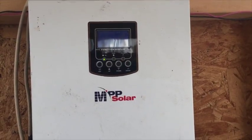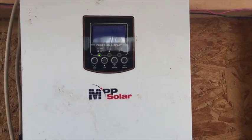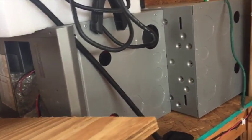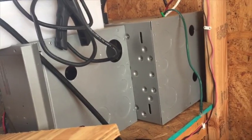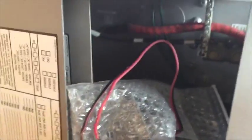I'm meticulously taking batteries apart, reassembling them, and testing them — but soon you'll see what we've got going there. I've secured an Outback Flex DC and AC side breaker set. I'm going to get those mounted inside the enclosure. It may end up on the side of the home to clean that look up, and the other will be hooked up alongside this. I might even mount the batteries inside of here — I have plenty of room on the walls once I move those mounting plates.